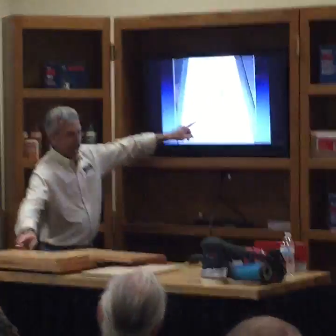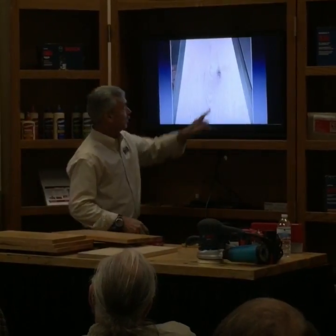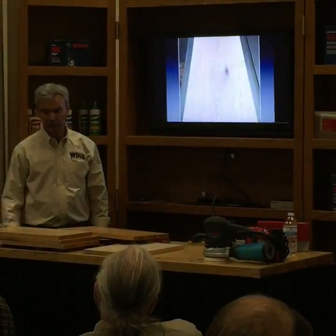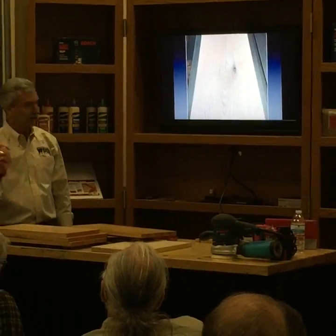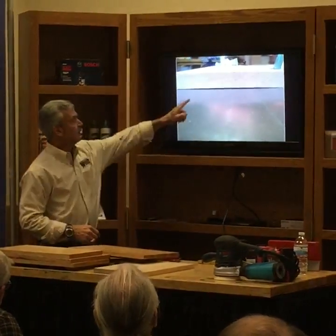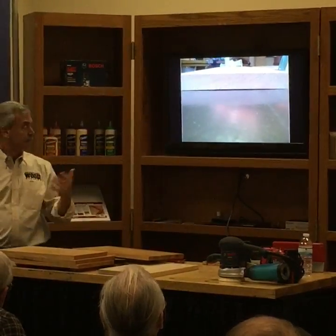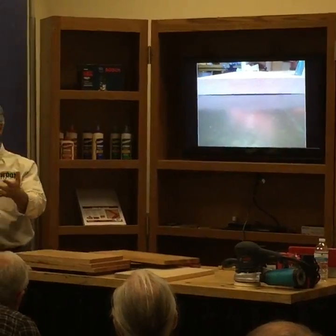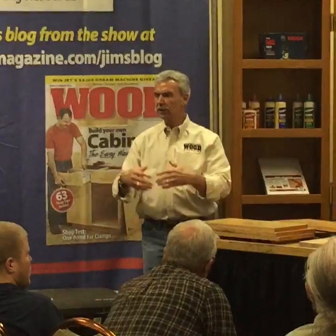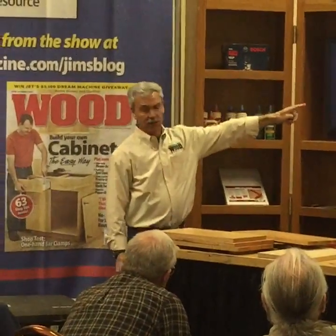Here's this wide board, this is it here. That's, give or take, a 10-inch wide board. Here's one of those inclusions. Putting that in a glue up is a pretty cool thing. Somebody comes up and touches it, they can see right away there's something interesting in it. And when I laid it on my table saw, it sat up from flat about 1/8 of an inch or so in that 10-inch wide part. The fact is that most of you know that there's no way to clamp that out or glue that out because the board is dynamic. It's going to expand and contract with those seasonal humidity changes forever, and that's going to cause a problem.